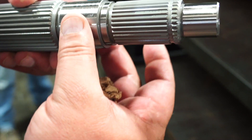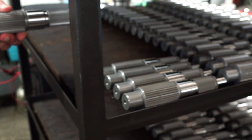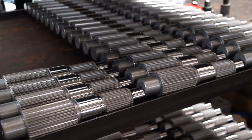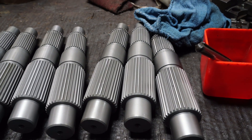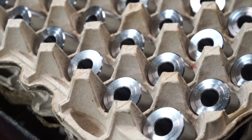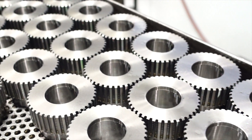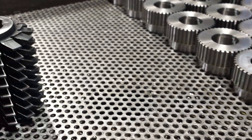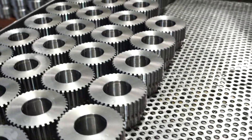When they come back from the grinder, they've got all these precision bearing finishes. You can see the tip where it rides in the bearing — these have been ground to spec after heat treat because parts change size in heat treat. They've still got one more grind to do on this particular shaft. You can often tell a heat-treated shaft because it'll be a dark gray color, not shiny metal like those transmission main shafts over there that haven't been heat-treated yet. These are special machines that actually hob or cut the teeth on — look at that cutter. They're all CNC.